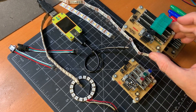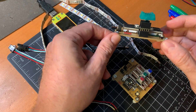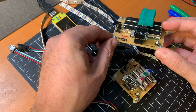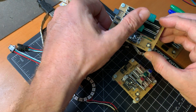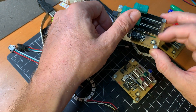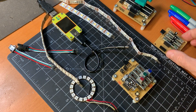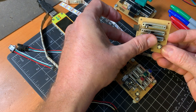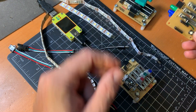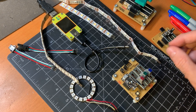I made a couple of versions before this. This one has 60mm faders — it's pretty nice but it's a little too big and too tall. Those faders are from Amazon and they feel nice; they've got these little felt dust shrouds. This version uses 35mm faders from Amazon that are not very good — they have a centered detent and are quite noisy. But it still works and I can use this as a carrier board for a Trinket in the future perhaps.